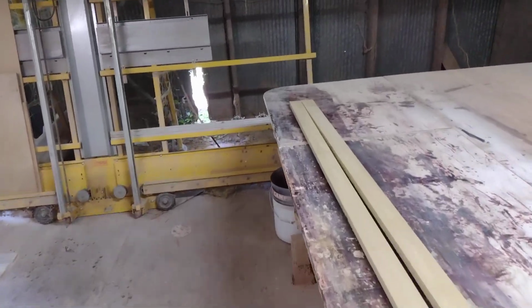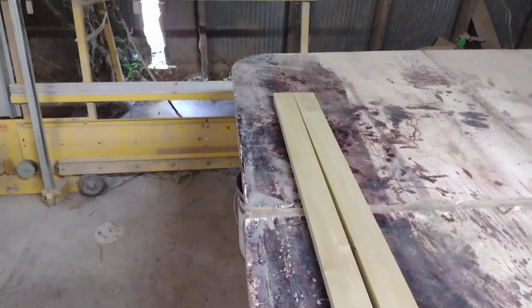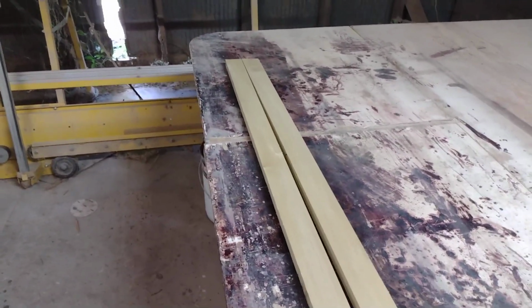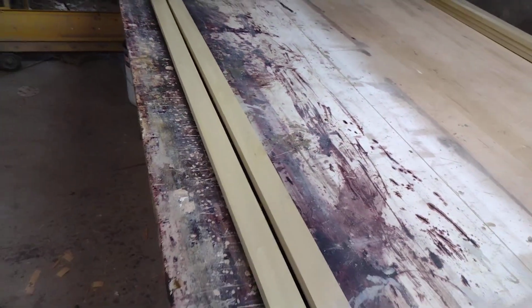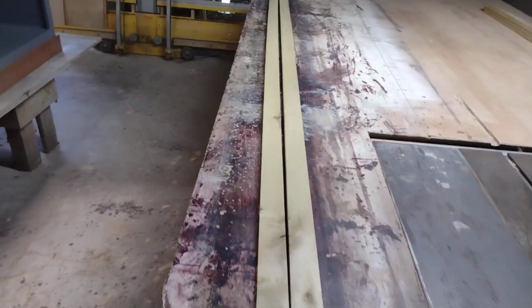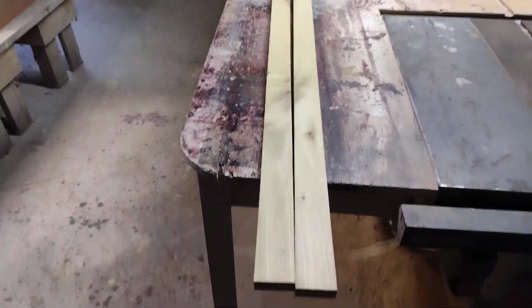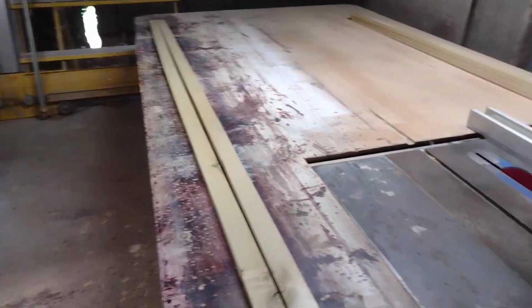That's what happens a lot of times when you cut a piece of hardwood or softwood, don't matter what it is. This is poplar. But if you cut even pine or anything like that, that board can take off either which way it wants to go. It'll either bow out, bow in, or stay straight. But you got to prepare for it. That's the whole key.